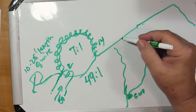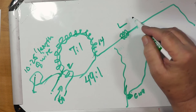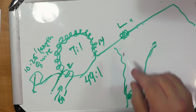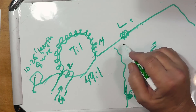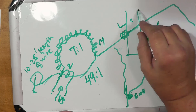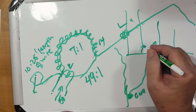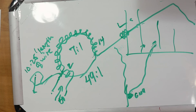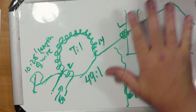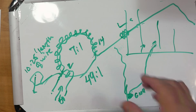Now the question he raised: why are there other inductors? There's one small inductor a few feet in that goes for a few turns. It has a small amount of inductance and an even tinier amount of capacitance. What this does is move the 80-meter frequency up a little by providing some loading. It affects the other bands too, but not so much — it's mostly for the 80 meters.